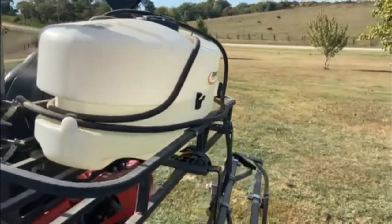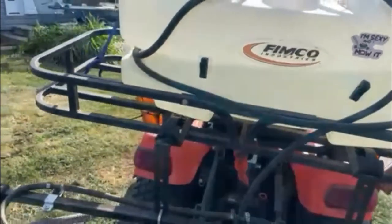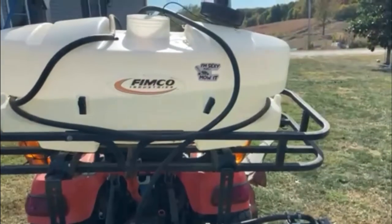So first, simple troubleshooting: make sure you've got water in there — this is about halfway full. Kind of look around and see if you see any kinks in the line. Take the top off and look inside — I don't see any obstruction. I reached my hand in there and there's no obstruction to the line; the line is definitely under the water. So I'm going to drain this tank, pull the strainer out, take a look at it, and hopefully that's where our problem is.